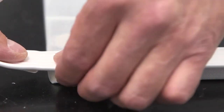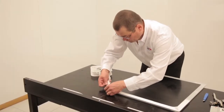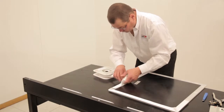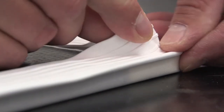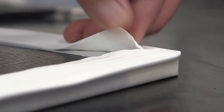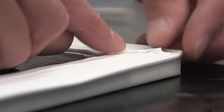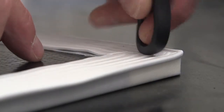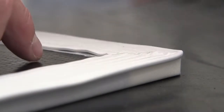In order to ensure a continuous seal, the SKYFLEX should be formed around the corner. A cut at 45 degrees should be made, leaving approximately 2 mm of material uncut. The remaining material should be laid smooth and compressed, aligning the ribs. The continuous seal should be at least 5 mm and consist of the large rib and at least one other rib uncut.